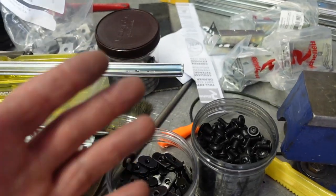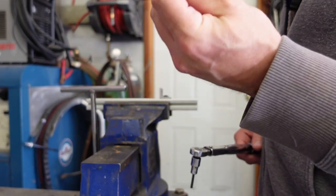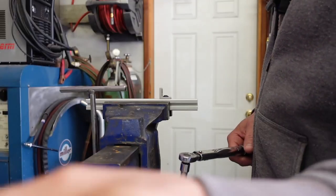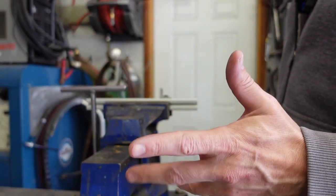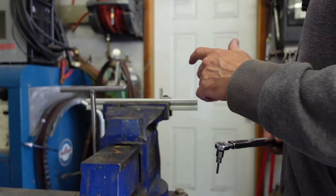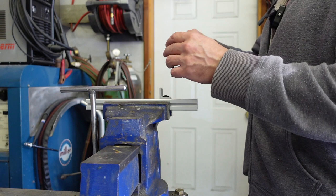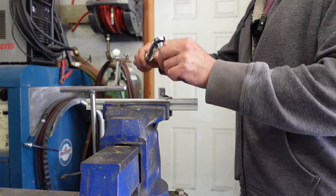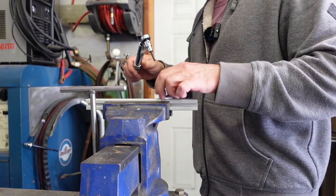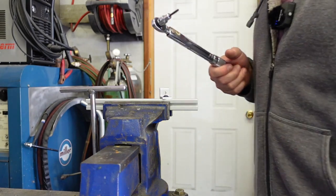I don't want to wait for new ones — I've already waited too long for parts. The fasteners these things use are quarter-20 thread, able to be torqued to about eight foot-pounds, which is 95 inch-pounds. So I'm going to stick a fastener in and see how many inch-pounds we go before we strip it. 25... 50... 75 is still good. Alright, good — we can get to 95 inch-pounds.